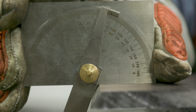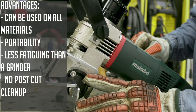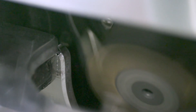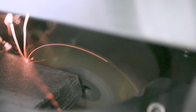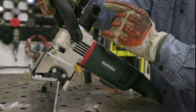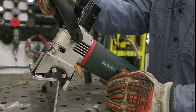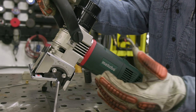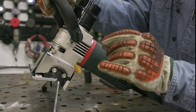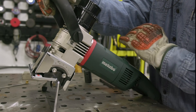Let's go ahead and move on to the nibbler. So this is a nibbler — essentially what this does is it allows me to bevel plate mechanically. It's nice and portable, not too heavy. I'll be able to take off all the stock I need to get a good bevel. I set the bevel, so that's going to give me improved accuracy, improved speed, and less wear and tear on my body. I'm going to take off about 3/16ths of an inch all the way across, then pull off the remaining stock. You could probably do 3/8ths all in one fell swoop, but to get a nicer cleaner bevel, we'll remove a smaller amount on the last pass — take off a good chunk the first time, then the second pass get it all cleaned up, and then it should be ready to weld.